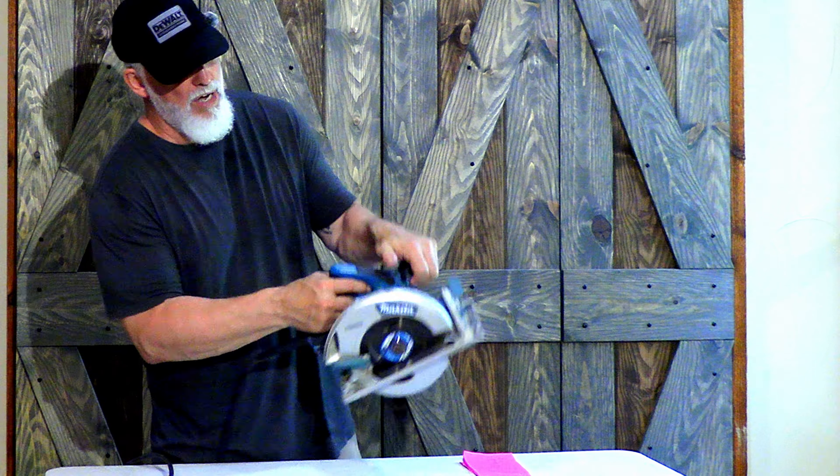But if I'm working outside and it's hot, I don't want to run and get a portable table saw, bring it over, and set it all up just to cut one piece of wood when I can do it quickly with my circular saw. How that works is you have a lever in the front here — you raise it up and now this tray moves and I can lock in at my 45 degrees. So when I cut, I'm going to bevel my piece of wood, whatever it is I'm cutting. That actually helps you and saves you a bunch of time.